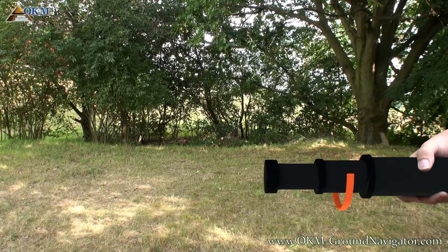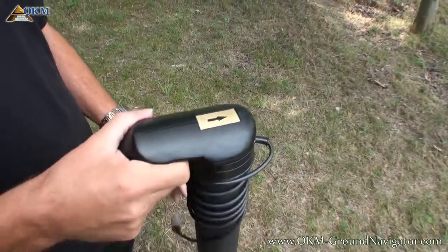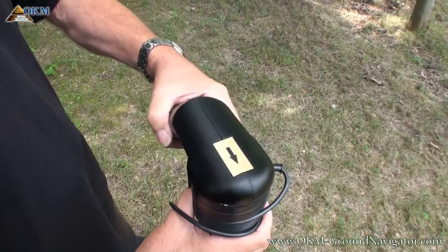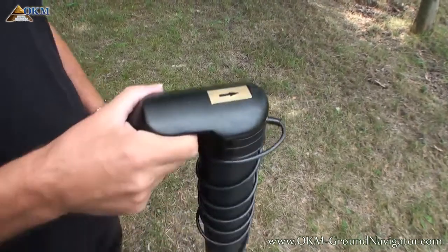After extending the supersensor to your personal needs, you may attach the mountable handle. Therefore, you place the handle perpendicular to the probe. Then you push the handle on top of the probe and turn it by 90 degrees. Now you can carry the probe by using the handle.